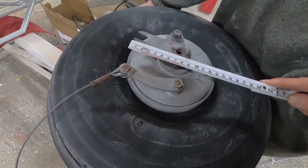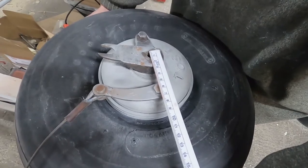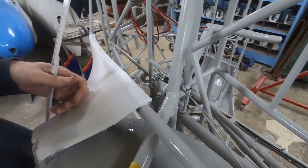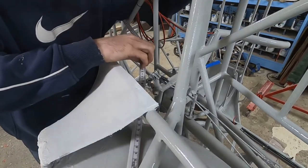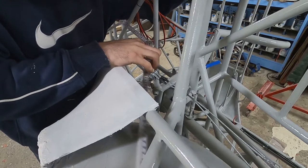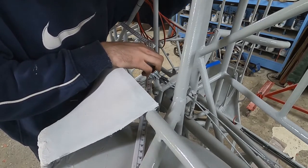The first of those jobs is to make a hole in the wheel well for the main wheel. This hole is used to feed the cable from the air brake lever to the main wheel brake assembly. There was a hole in the wheel well when we got it, but over time it got a very weird shape and we decided to make it look a bit nicer. Since we took out the wheel well, it might not be exactly in the same location anymore after putting it back, so we carefully measured the location of the brake lever on the wheel assembly and drilled the hole.